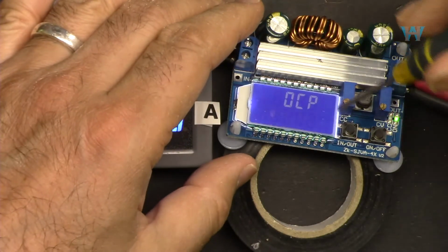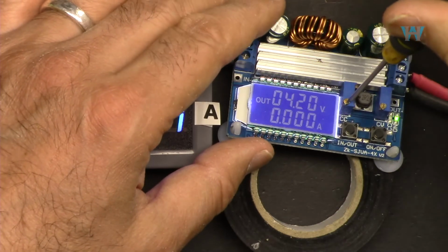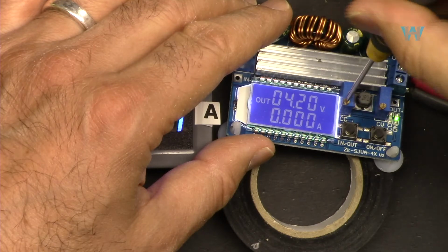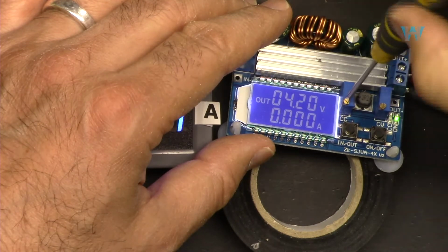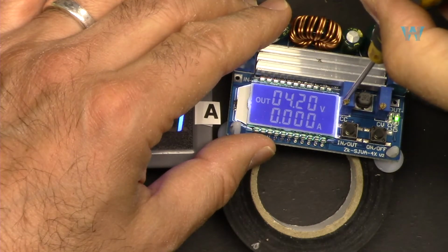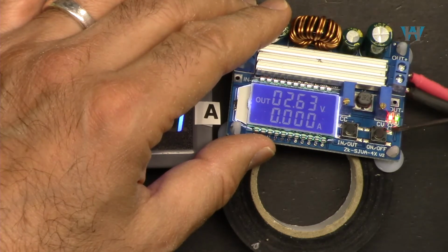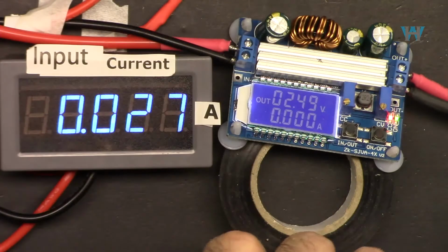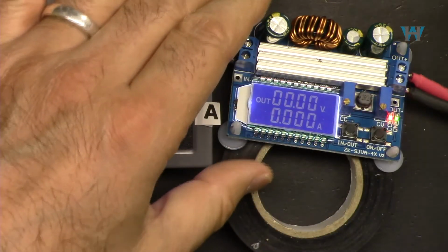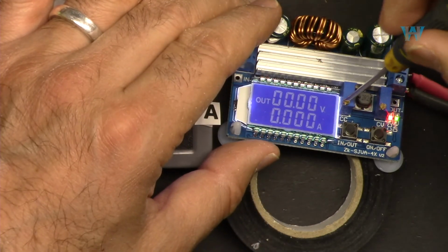So I've short circuited that. You see, over current protection, it says. So first, let's rotate this counterclockwise until you hear a click. So when you set it to the minimum, you will see the LED, the red will turn on. Do not worry. Now let's short circuit this, and do not worry. And now it shows the current. This is the current. Let's turn it slowly,